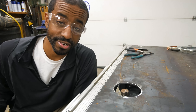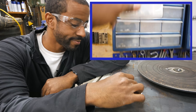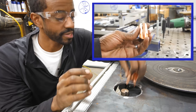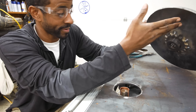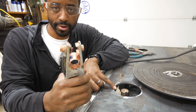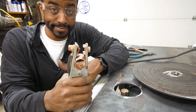The last issue to solve is how to ground this plate while it's spinning. What I decided to do is take a spring I dug out of one of my reservoir boxes, drop that on, and then take a little piece of copper pipe, cut it open so it slides over the shaft — this will rub against the bottom while it's spinning. The clamp from the other side goes on like so. This should allow the shaft to spin, granted with a little bit of friction, but I'm not terribly worried about it with the amount of power I have. Maybe it'll work so great that I just leave it.